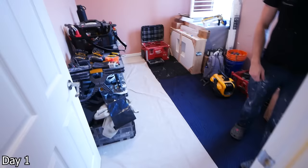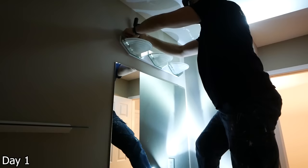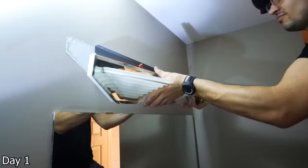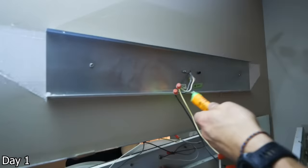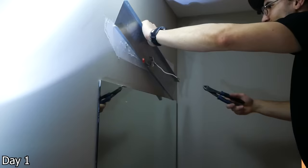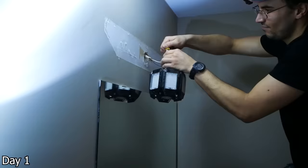With any of these projects, we require use of a bedroom close by to store the many tools and materials needed. Very common with these types of bathrooms is to have no ceiling lighting and just rely on an older wall sconce. Many of these are installed with a couple screws on the top and bottom. Take a Phillips screwdriver, loosen the face plate, and reel the wires from beneath. Make sure it's powered off and verify that with a non-contact voltage tester. Once you know it powers off, remove the wing nuts and the back plate screws. There may or may not be an octagon box behind the fixture — builders often skip that step. We'll then tie on one of these temporary pigtails with a bright LED light to help us see throughout the duration of this project.